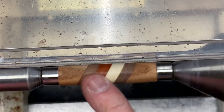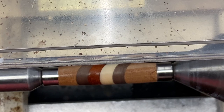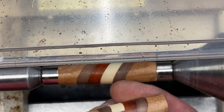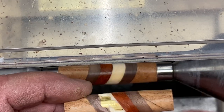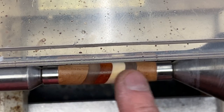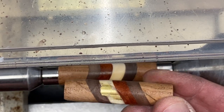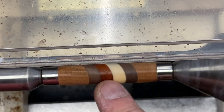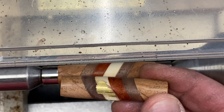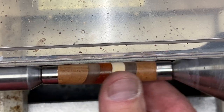The blank looks really, really nice. You can see an area there where I had to keep CA glue on there to keep from losing it — I'll probably hide that behind the clip. Full disclosure though, this is not the original blank I started with. This is the original blank. I let my tool get dull and I ended up taking a chunk right out of the blank. I kept taking my skew back to the strop and stropped it probably four, maybe five times. That's what's going to happen if you're not careful, because you are going across grain. If you look at these, you can see the change in the grain, and if you're using any type of tool and it is dull, you're just going to rip the grain right out of there. So that stinks that I lost that blank, but I did put another one on there and it looks amazing.